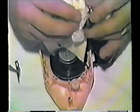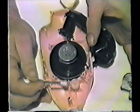Okay, on the brake, it is best to go ahead and wipe off the end of it. Make sure there's no grease on it. If you want, we can put a little bit of Vaseline with a cotton swab in this hole for the brake, so that when you reinstall it in there, it will be lubricated. You want to be very careful that you don't have too much there so it doesn't get on the new O-ring.